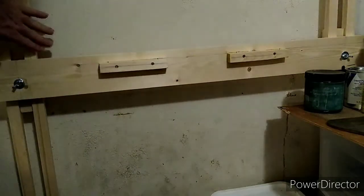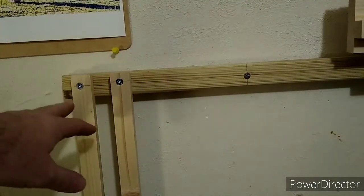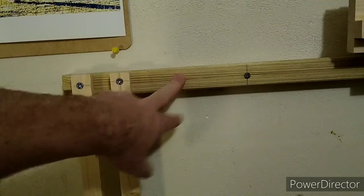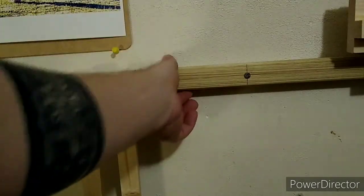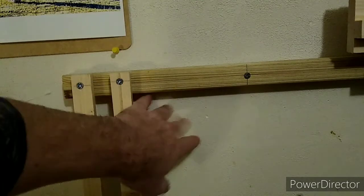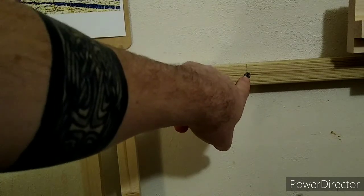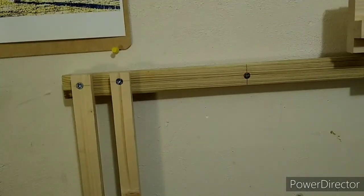There are two rails here and here, and the top one is just centered on those. For the wall brackets, I used inch-and-a-half screws into the top and bottom of each one-inch rail. They're screwed into the pressure-treated backing, which I actually doubled up because it's not as thick as the front boards — so the back couldn't slide up and down since it was up against the wall. Doubling them up works fine. The brackets are attached to the wall using two-and-a-half-inch deck screws screwed into the studs.